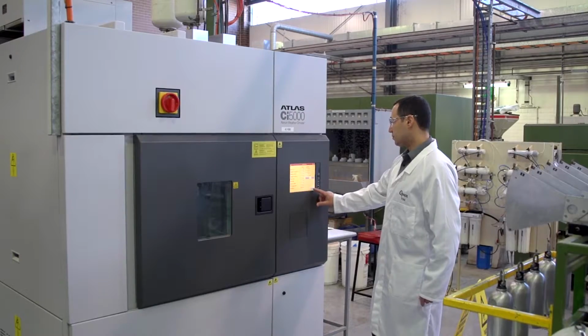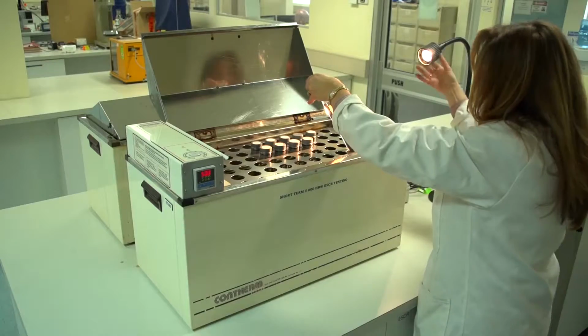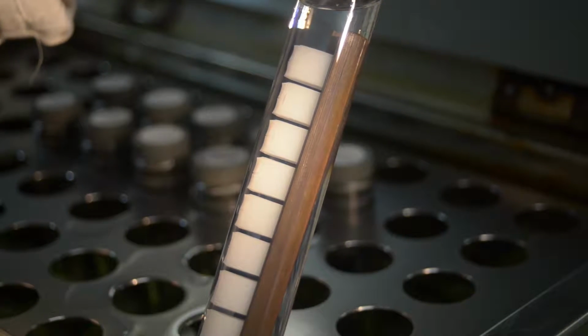Alkatuff 711 has more than double the UV requirements specified in the Australian standard for polyethylene tanks. The Australian standard for water tanks requires that the material has a UV8 rating. Our resins have a rating greater than UV20, so that means that the tanks will far surpass the requirement of the standard. Alkatuff 711 meets the stringent requirements demanded by the Australian standard for resistance to environmental stress cracking.